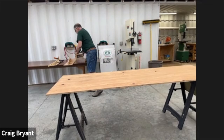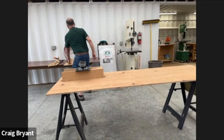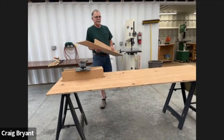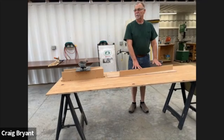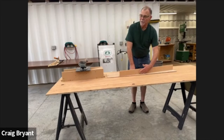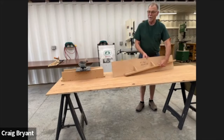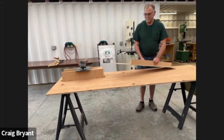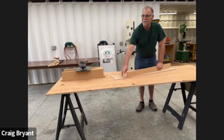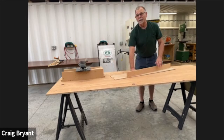I brought 2 jigs. One is very generic. We do all kinds of rails and other things with this. The limitation is that the maximum width is 2 3/4 inch on my saw, because I'm laying a board on its side here. The critical element of this is marked here as an 8-to-1 taper, and the fence setting. I want to make sure that it's very close to the fence, so there's no gap by the blade. You can actually slice a little off of it; it won't hurt anything. It still works fine.